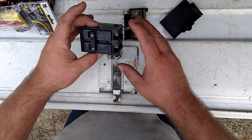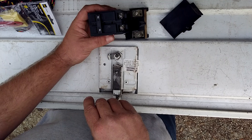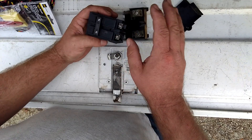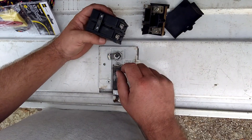Back to the panel — this is the main 70 amp. It's like an E2H2 or something like that, I don't remember exactly. But that was the furnace — it was a 12 kilowatt furnace. That's why it has a 70 amp breaker.